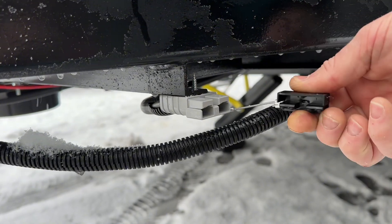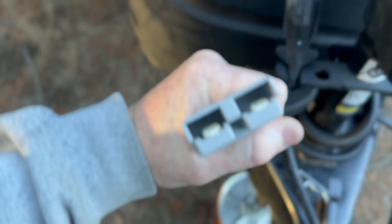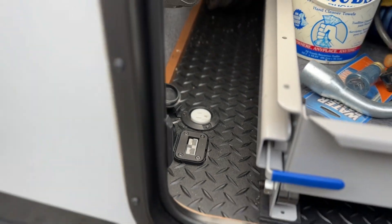At that point we're looking around for any other little extras the customer might be getting. In this case the customer's getting an external solar port with an Anderson connector, so you can plug in up to 600 watts of ground panels tied into another controller underneath the dinette. We might also run cable for an Anderson connector at the front for a DC to DC charger, or build some extra 120 volt outlets in the RV's pass-through. As it gets close to the end of the install, Jake and I like to run through everything — rehash what exactly we've done and what's left. The roof is totally prepped for solar panels, the bed is completely done and cabled, 120 volt is ready to wire in at the last minute, Touch 70 is wired in with HDMI and USB run, and the little extras like the external port and Watchdog are all there and ready.